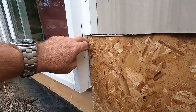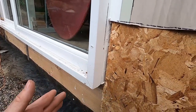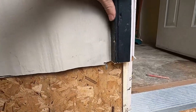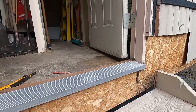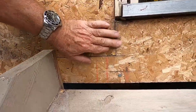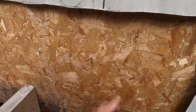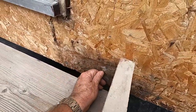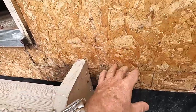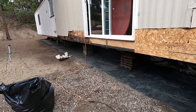I've trimmed off the flange off the patio door so I'll be able to run my flashings right up to it — ready for when I put the new door in. Same thing here — I've opened it up around this opening, taken off the brick mold, and cleaned it up to the bottom of the opening. Now I can put my new tar paper and flashings on when I put the new deck on. This end of the deck is all fine — there's a little discoloration on this OSB but it's still sound, nothing wrong with it.